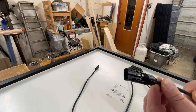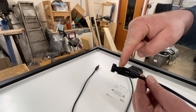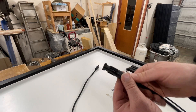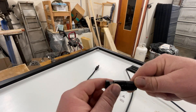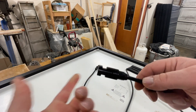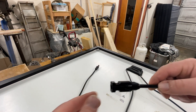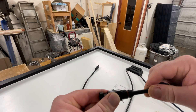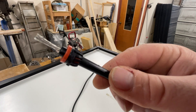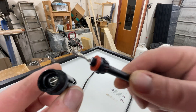This side of the connector is the female end, which should be the negative wire. To take these connectors off, all you've got to do is unscrew the back cap. It wasn't even on that tight — usually you have to use the wrench because it's supposed to be torqued down, but this was not torqued down. Look — the wire connector — they literally just had these things with a pair of pliers; they were not even crimped on there.